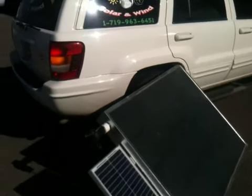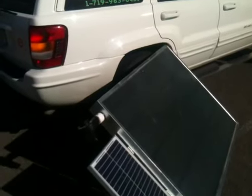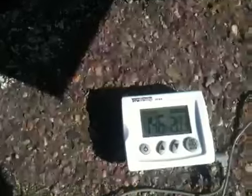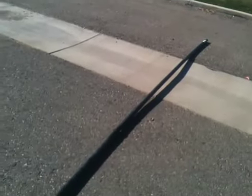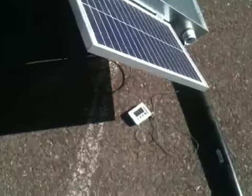What we want to do today is take one of our little heat panels and get a baseline reading at the output. Right now we're at 146 degrees and it's about 50 degrees outside today. What I have here is two 10-foot sections of the ABS pipe that we use to pipe heat into houses, and we want to see what kind of loss we get.